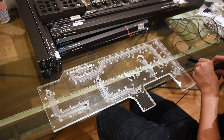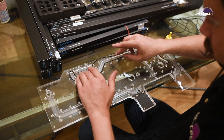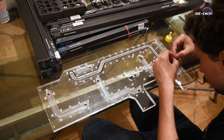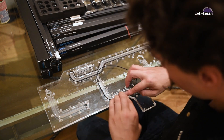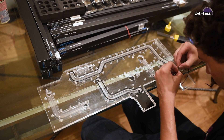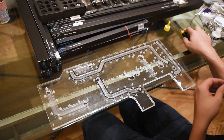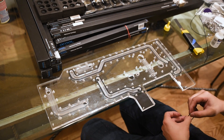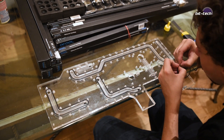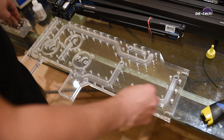Both sides have been successfully cut from either side, so now it's time to put everything together. I'm going to be using M4 16mm countersunk screws but first I need to make sure the O-rings are done, because otherwise there won't be any watertight seal. The way I like to do this is to make them myself — I use simple 2mm O-ring cord bonded together with cyanoacrylate super glue. You have to be very careful and make sure the ends meet very squarely, otherwise you'll have leaks and weak points. I use a very sharp X-Acto knife to ensure the ends are completely flat. Always put the seam by a screw hole to put it at maximum pressure so any internal gaps have the best chance of sealing. Using a flexible super glue like a Loctite one will give you a little more leeway as well.